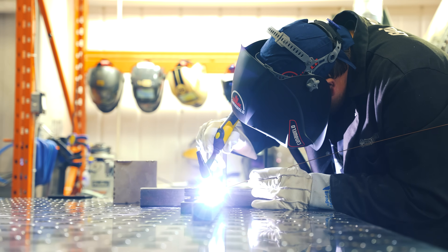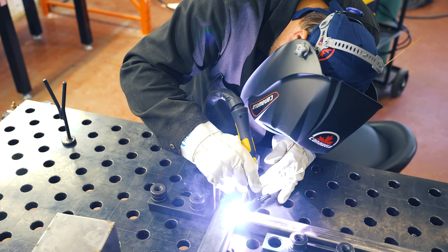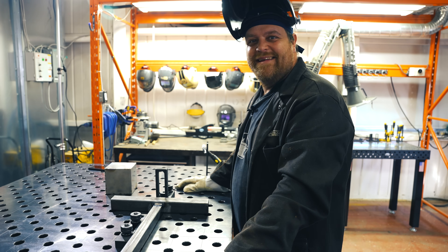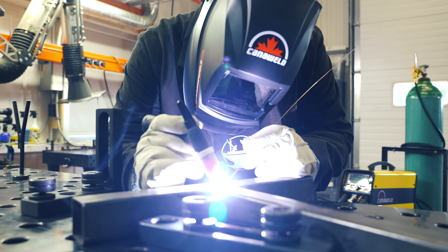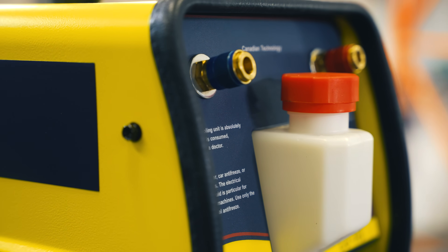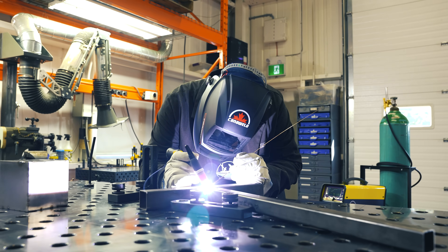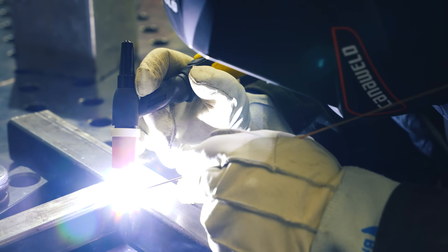There's no issue with heat or penetration or anything like that. Now, I am by no means a professional welder, but let me tell you, this machine makes me look like one. For any jig or anything we're building here, this is definitely more than adequate. And with the liquid cooling, the torch doesn't heat up. It's no slouch — it doesn't labor. When you lean on the pedal, you barely have to; you turn it up and barely have to work to get the heat into the material.